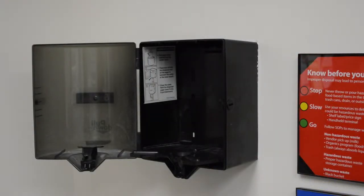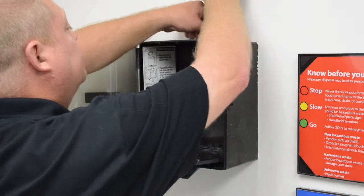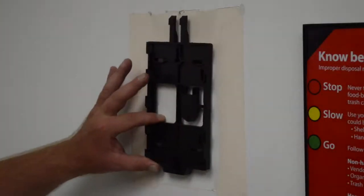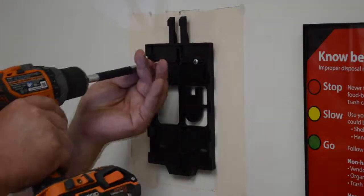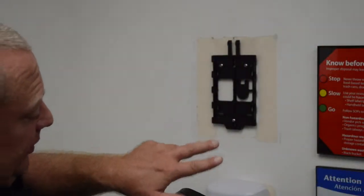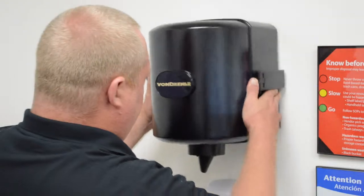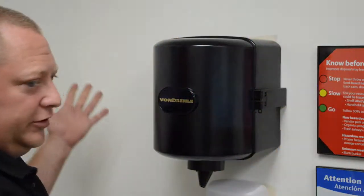To replace a Steffco dispenser with a new Vondrell dispenser, simply remove the old dispenser. No need to worry about damaging it since you are throwing it out anyway, so you can just use a screwdriver. Using the same holes and hardware, mount the Vondrell dispenser backplate. Use at least three screws to make sure the dispenser is secure. Finally, mount the new Vondrell dispenser onto the backplate. It's generally easiest to do if you line up the keyholes with the tabs on the backplate, push the dispenser onto the backplate, and seat it by pushing down firmly.